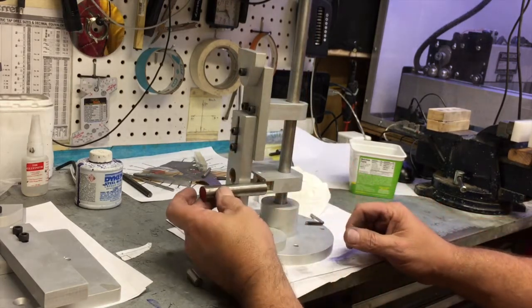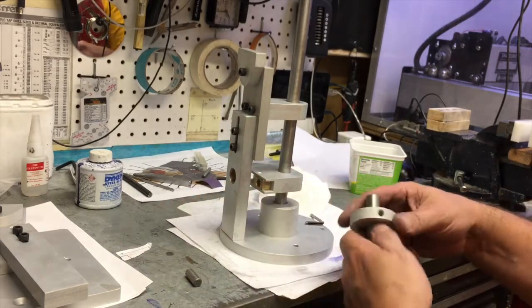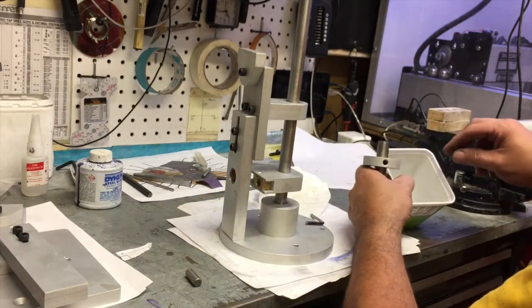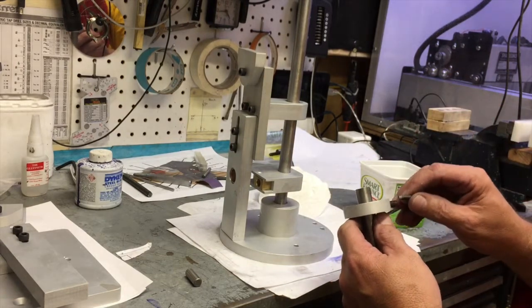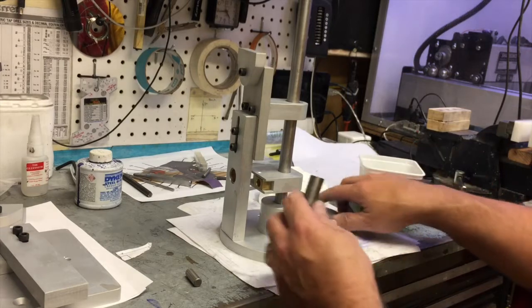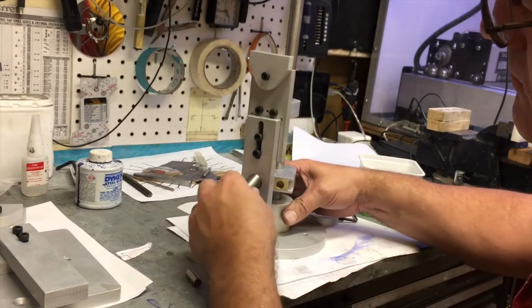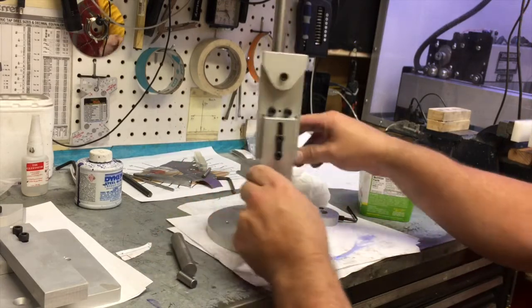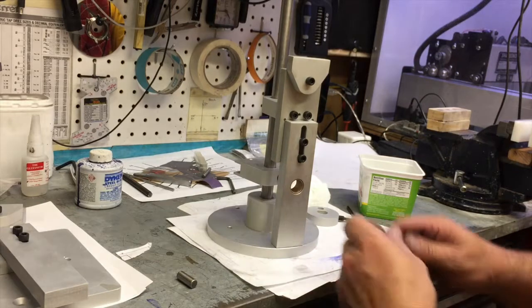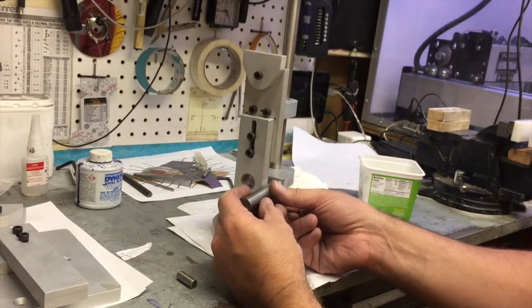How I'm sliding the crank between that thrust washer and the yoke is actually probably a smart thing to do when you're ready to fit it. You're going to need to sand the front face of your yoke so that your crank slides in between. Also, I'm not pleased with the diameter of the hole in my crank — lessons learned. The 0.625 hole should be about 0.624 to 0.6245; it needs to be a tighter fit on the crankshaft.